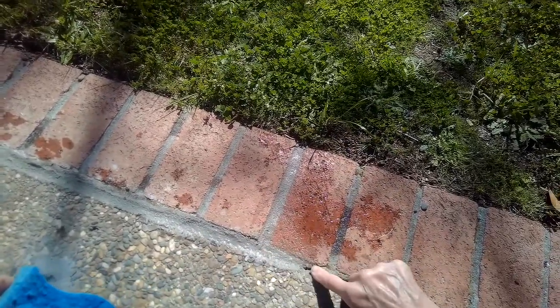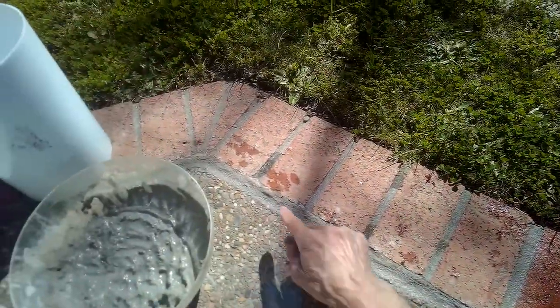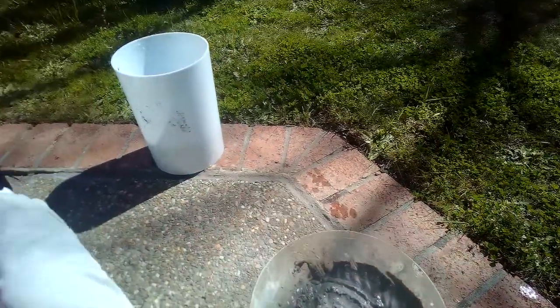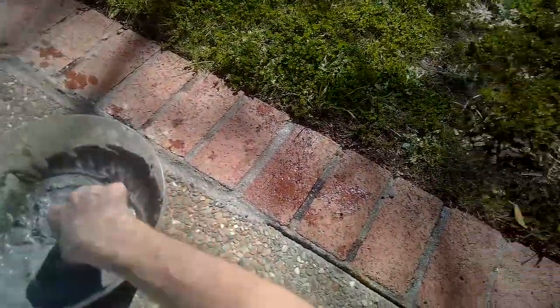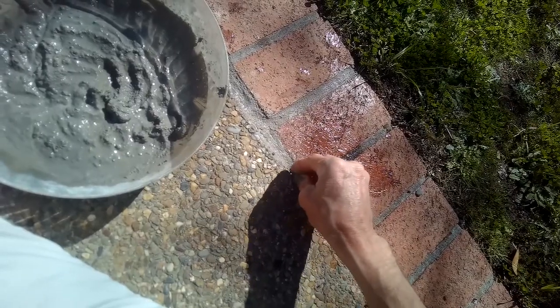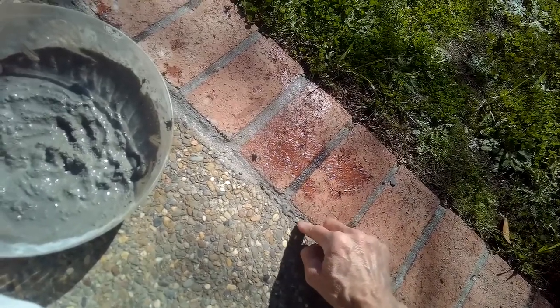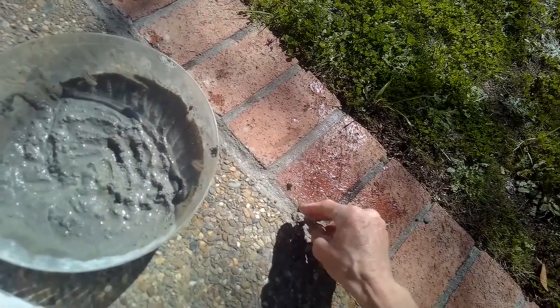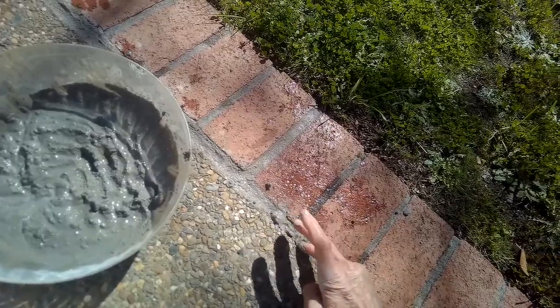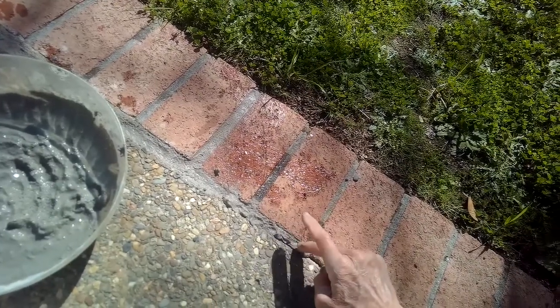That mortar mix will tend to get over more than it should and won't look as good. We have a lot of mix here; if it starts to get too dry, I can just add water and that'll allow me to keep working without losing the mix. I've got a little crack here so I'm just going to pinch it, let the material use gravity with a little downward pressure to fill the crack. Even a small crack left wouldn't be great because it'll allow water to sneak in and cause that expansion problem again, then you'll end up with more cracks.